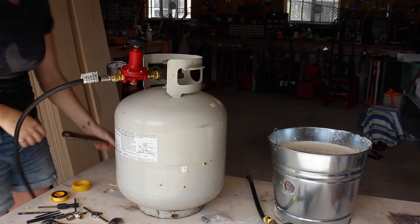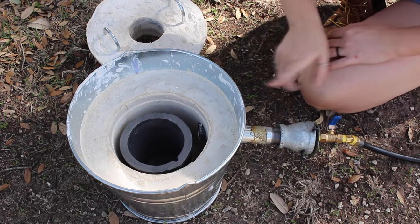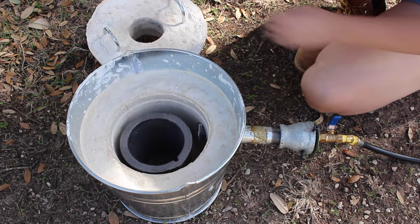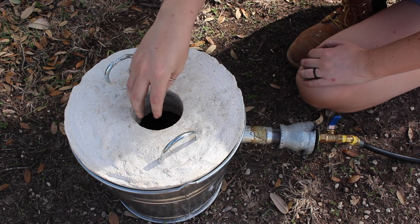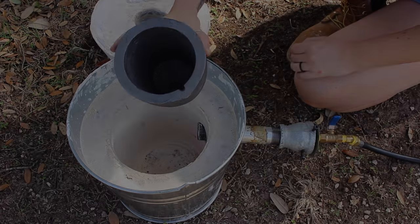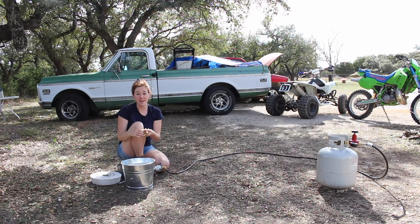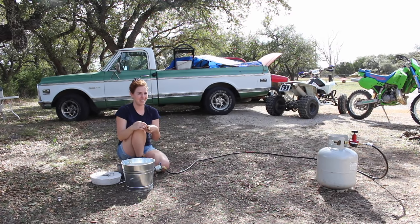With everything together, you can see the bigger picture on how this works. The heat comes in through the side of the foundry, the flame circles around the inside and heats up the crucible. From there, I'll put the cap on to retain heat and drop in my metal, where it'll melt fully in the crucible so I can then take it out and pour it to make a casting. Now that I have the foundry figured out, I'm going to be researching the sand casting process so that in the next video I can melt down this brass hardware and cast it into something I can keep forever.